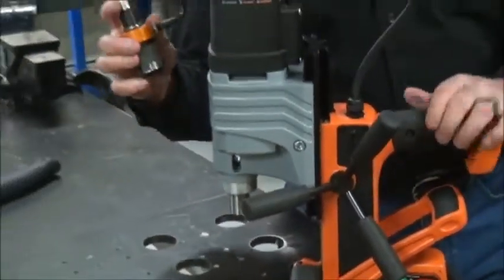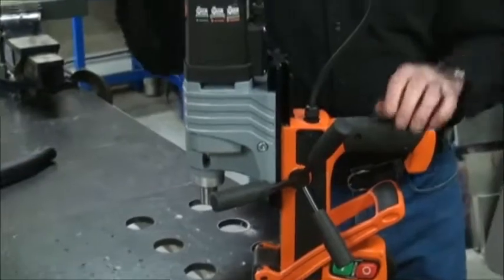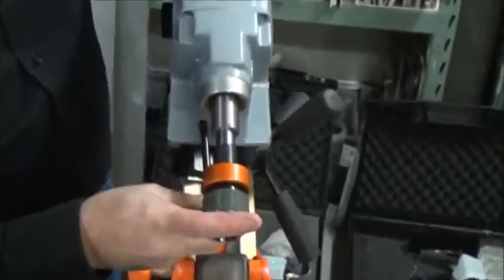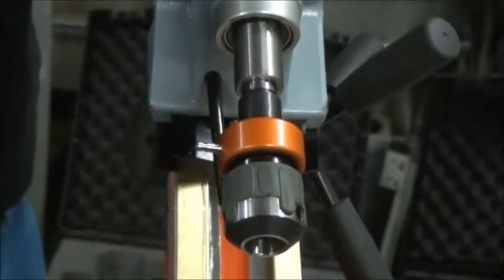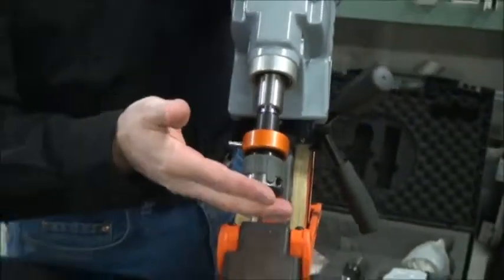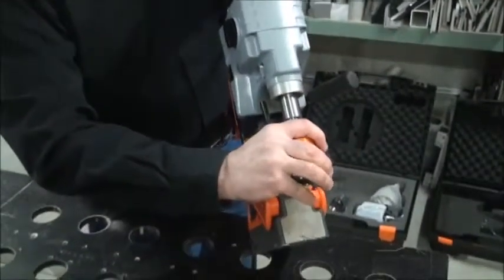This does come with a Weldon shank adapter because the motor shaft itself is an MT2 — a pretty standard industry-type shaft. So you're going to pop this Weldon shank adapter in if that's what you want to use. Simply slide it in, line up this little black bar with the hole at the bottom right there, and just give it a bump. That should keep it securely in place; as you use it, it will get tighter and tighter and won't ever fall out on you. When you do need to remove it, we do come with a little chuck key remover — slide it into that slot, give it a little tap with a hammer if you need to, and it'll pop that chuck right out.